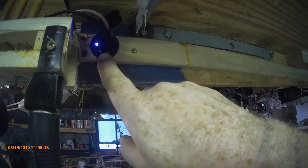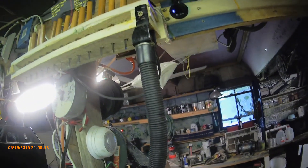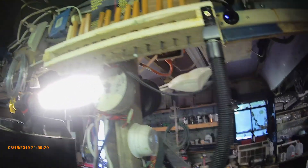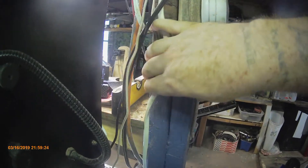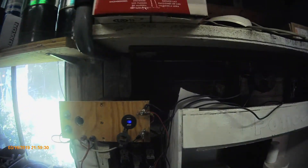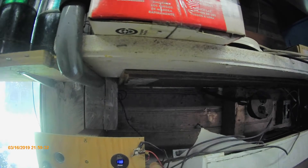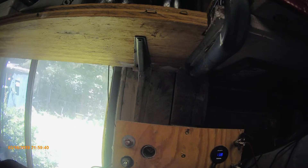What I'm doing is I am going to rig 12 volts up next to the table saw. I'm kind of telling you what I have and what I'm doing and why I'm doing it and why I'm not doing other things. Now I'm just telling you that I have two USB 5 volts up there at 2.4 amp each, so I don't need any more USBs. And over here I have 12 volts, which is actually off the batteries and solar, which brings me up to around 13.8 volts. I have a number of sets of connections there. I'm going to tie off the ones over to the left, the two big ones there, the top and lower.